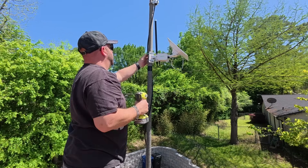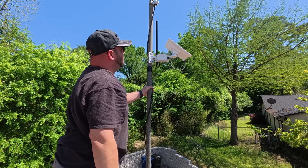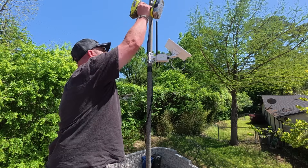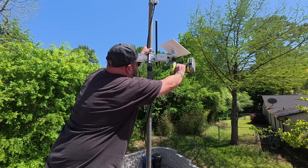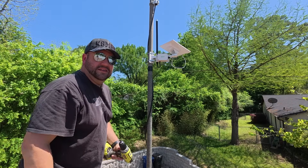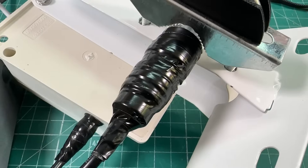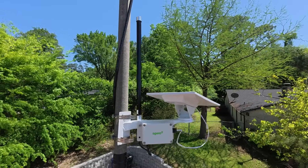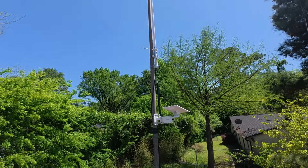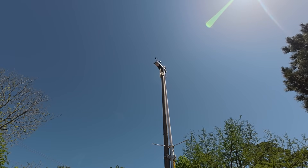Both clamps are on and I got it mounted right around where I wanted it. You can adjust the solar panel - somewhere around there should be okay; it's quarter to three and the sun is right there. Aiming it due south should work. She is installed and looking pretty sweet. I went ahead and put some amalgamating tape and then some Teflon electrical tape over both antenna connections to keep them sealed. Everything else should be pretty waterproof, turning into a regular antenna farm out there.